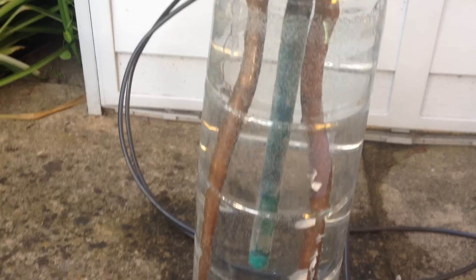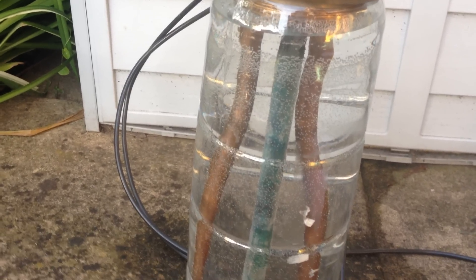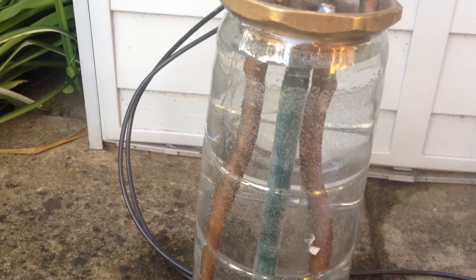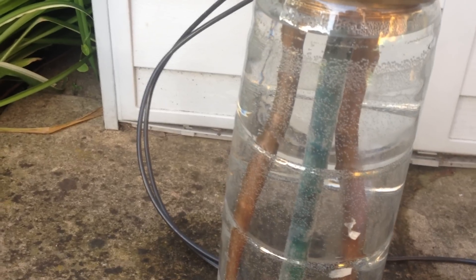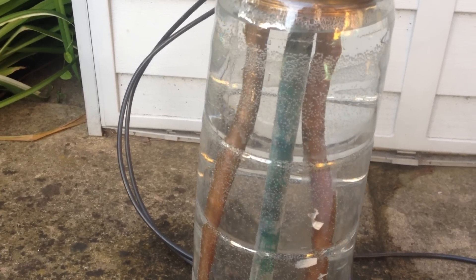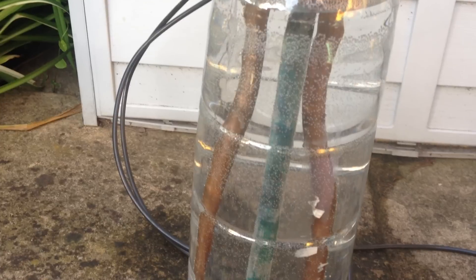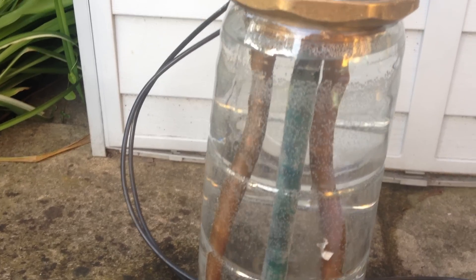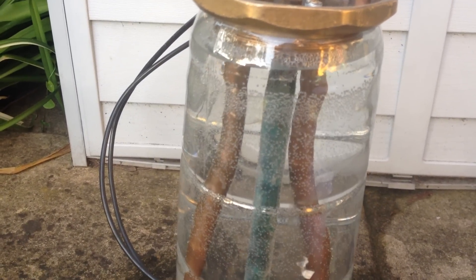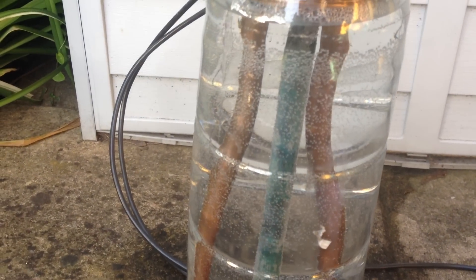I got a resistive wire — the resistive wire I bought was 1.25mm thick. You've got to get your resistance right for your wattage. So your resistance gives you amperage, and you times your amperage by your voltage to give you wattage. This has got 0.5 ohms of resistance, so 12 divided by 0.5 gives you 24 amps. 24 amps times 12 is 288 watts approximately. That's how you do that.